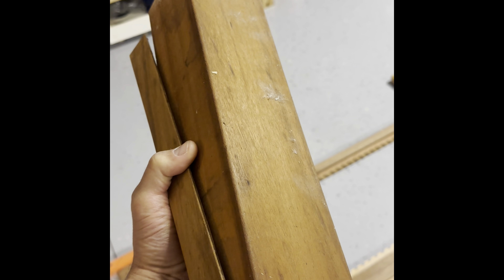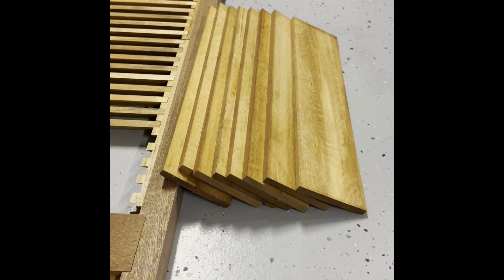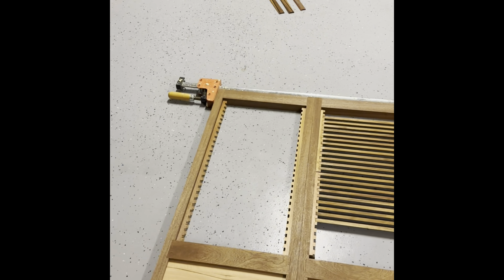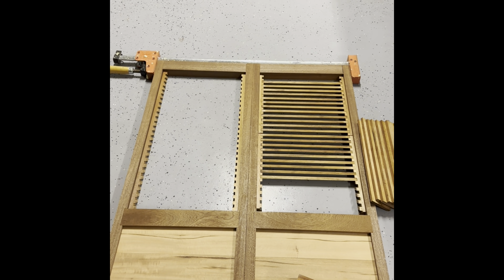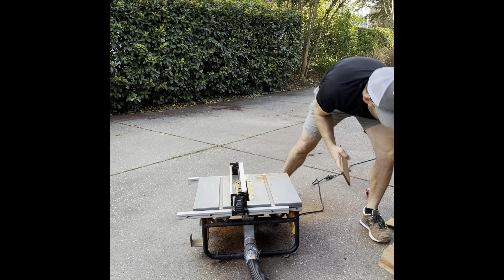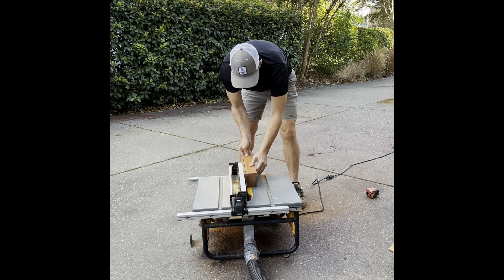I reassembled the table saw and cut these strips to hold in all my slats. I almost had enough slats for one door, so that's the project now — on to making some more slats. The slats actually came from this four by four post I had left over. I had several remnants about the same length, cut them into sections, getting about two slats per piece, then feathered or cut each end at an angle to make it flush.